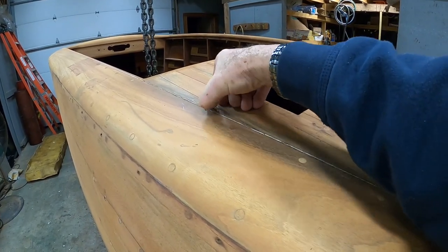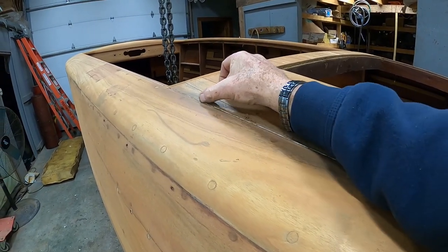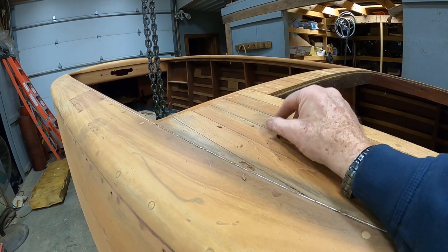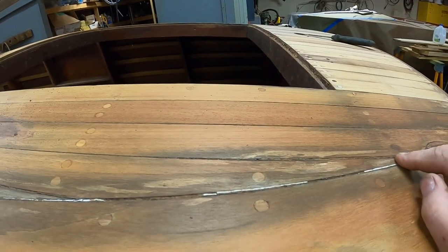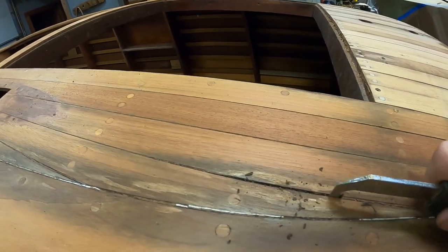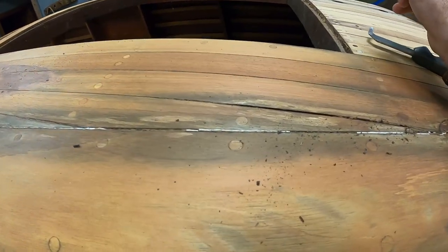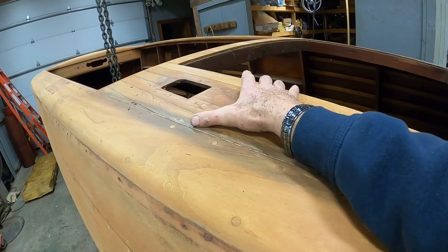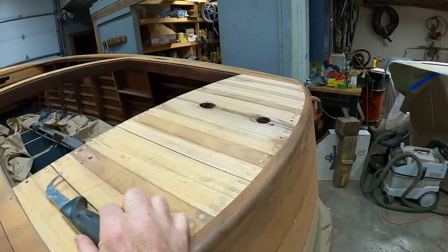This seam that you can see is now filled with some white material — it's supposed to be yellow and will be yellow before we finish. I get questions fairly often about what causes really dark areas. We strip with stripper, then go back with stripper and steel wool scouring pads — repurposed from the kitchen — and scrub and scrub, which bleeds all residual stain out of the wood. But here, notice it's black. Unfortunately, black means dry rot.